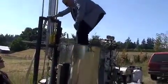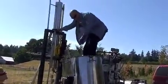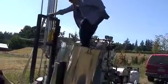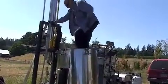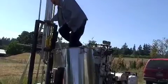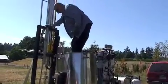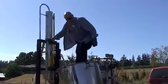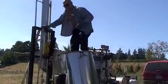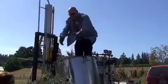Robert, can you tell us what you're doing? Well, I'm packing the still as tight as I can in order to get as much raw material inside the distiller. The reason I do that is twofold: one, to minimize reflux, and secondly, to maximize my yield per batch. The more raw material you have, the more oil you're going to make. Let me just get a couple of bundles.